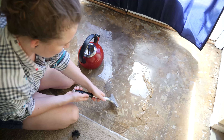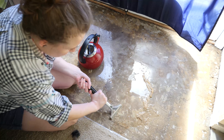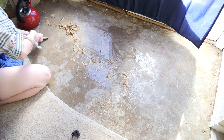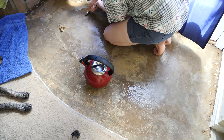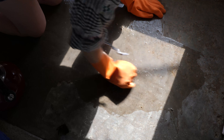Now that I've got all the paper residue off, there's still a lot of dried glue. I'm using the same boiling water and scraper method. This concrete section backs up to carpet which I don't want to get too wet. Now that it's just glue there's a lot of excess water, so I'd suggest having a mop and bucket ready to soak up the excess every once in a while. When working around the edge of the carpet I poured the water directly onto the glue then scraped it away towards the middle of the concrete to keep the carpet from soaking up the excess. Yes, this method was messy, but compared to using the solvent — having to wear gloves, eye protection, keeping the puppies away, keeping the area well ventilated, dealing with the strong smell and then the cleanup — it was so much simpler. When I finished with the hot water method I just mopped up, rinsed all my tools and I was done.